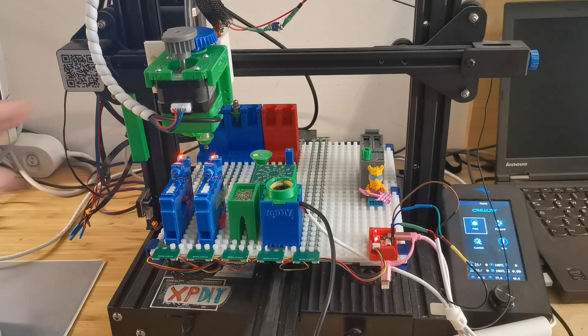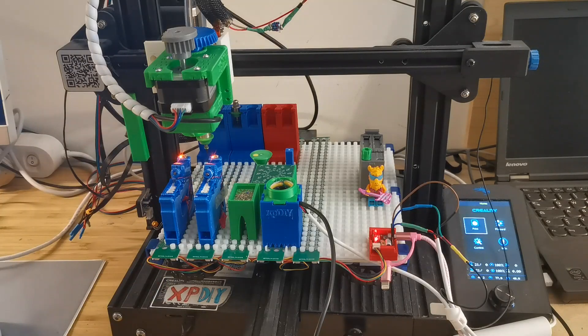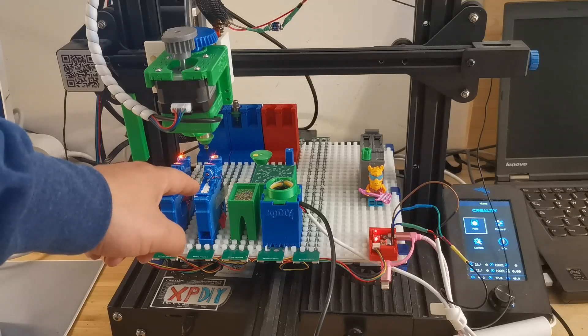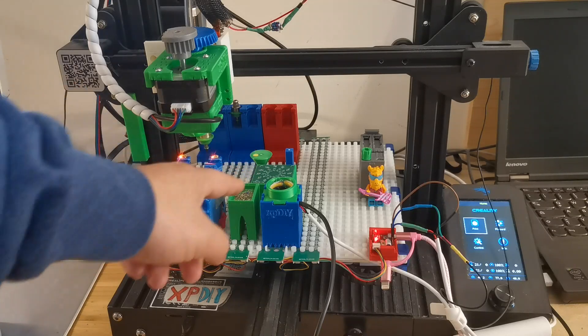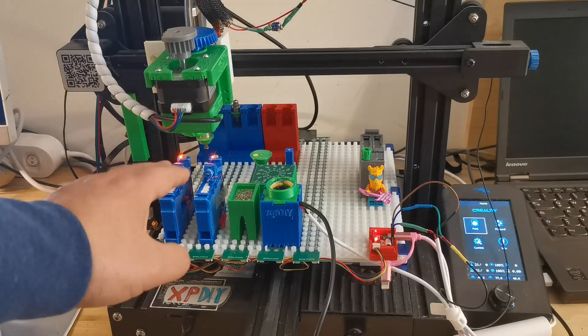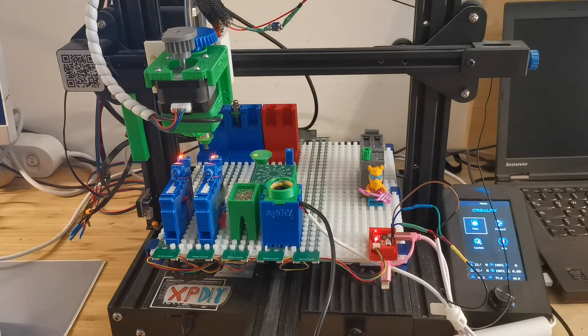I actually tuned the acceleration and also the jerk to be higher, but I think this is still not the highest. So then I want to do a test. The first time I want to let the camera look at the tape every time and then do the placement, and later I will set it to only look at the feeder at startup and then do the placement — and we'll see how fast the placement speed can be with this optimization.